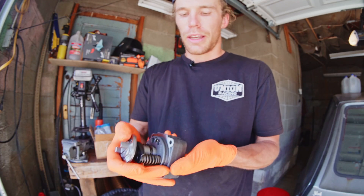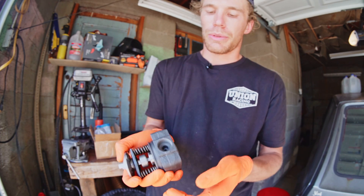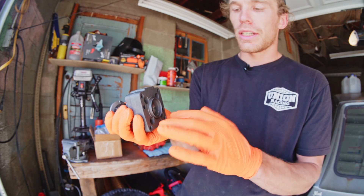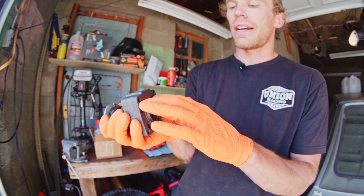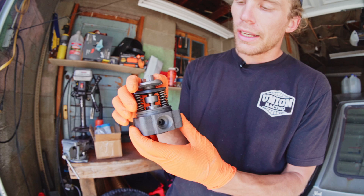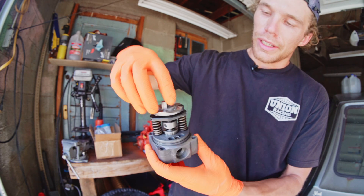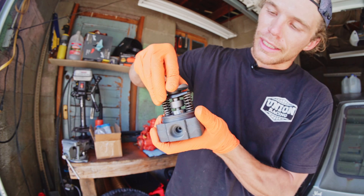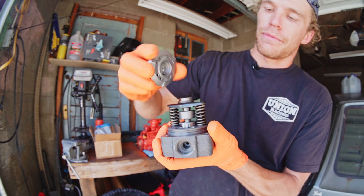Here I'm holding a pump head. Normally these two ports are plugged and these four holes are the fuel injection output — pressure comes out of these four ports and goes to my four cylinder engine. On the inside we have the cam plate, which is wavy. There's a set of rollers that pushes on this and compresses the spring mechanism according to the size of the cam plate.